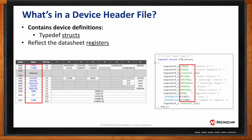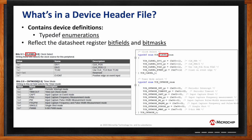Beyond typedef structs, the header file also contains typedef enumerations, or enums, which reflect the data sheet register bit fields and bit masks. For example, clock select appears exactly in the data sheet as it does in the header file. In the enum, you see tcb_CLKSEL_enum, with settings like div1, div2, tca0, and event — all reflected exactly. These settings end with _gc, which stands for group configuration. This allows you to set all bits in a bit field at once, rather than manually setting or clearing each bit — making your job much easier and less error-prone.